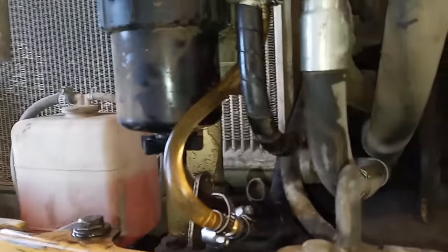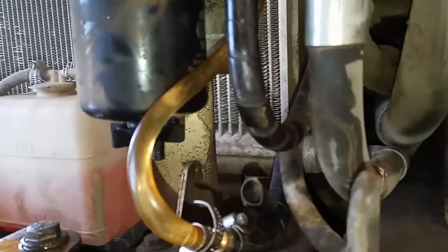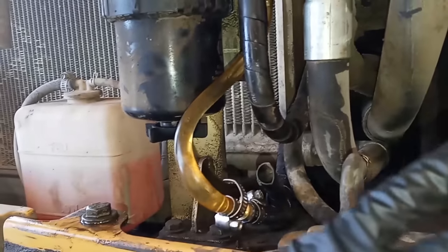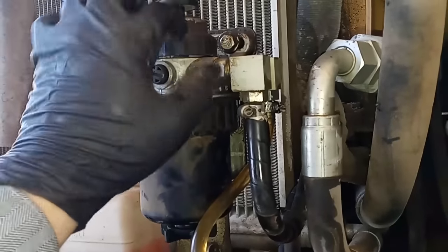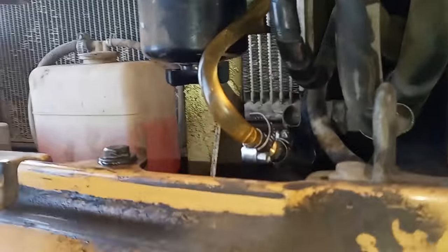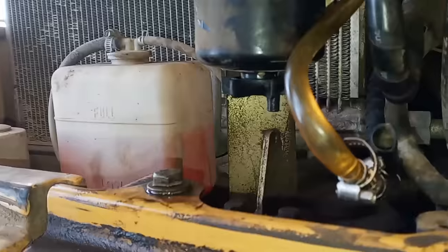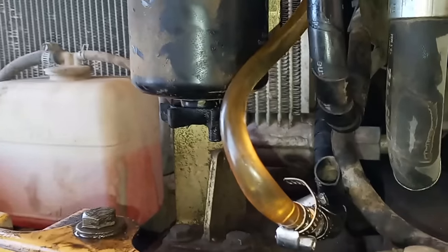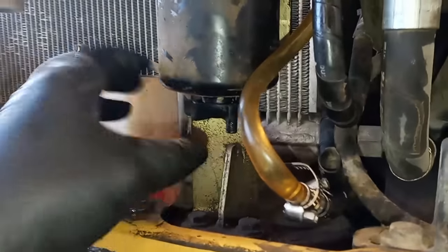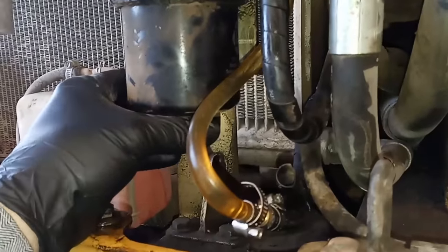When I showed you — when you pump this, we'll get a whole bunch of air. It's basically all air. So this definitely needs replacement. This is a NAPA filter, not a Cat filter, which you know my preferences on. One thing I noticed is this was not fully tightened — it was somewhat loose. You don't have to crank these down with an impact, but we're just going to tighten that a little bit and see if it makes a difference.